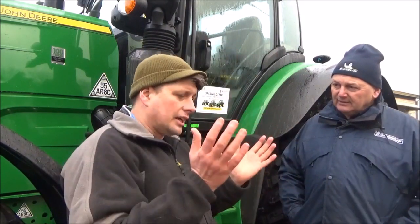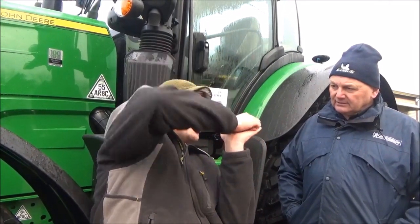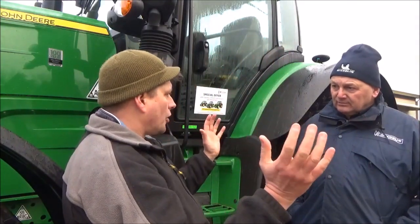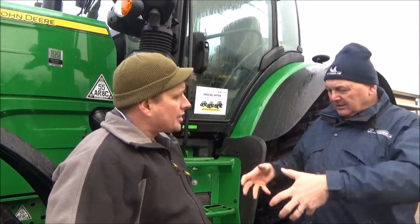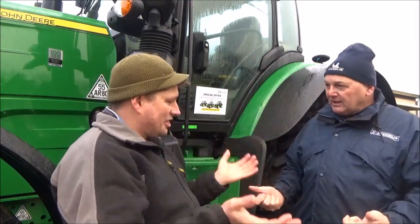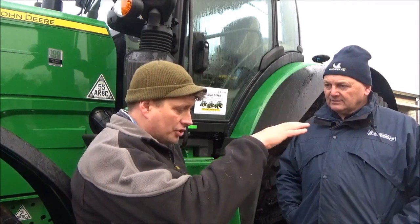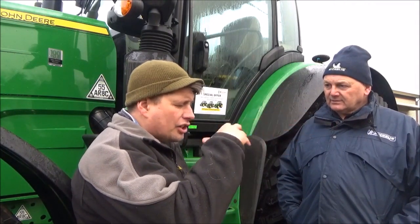Rather than just a little point being in contact with the ground, Henry almost had like a crawler track footprint - it was phenomenal. I've shown you a picture of the Evobib and the differences between a road pattern in the sand - the one that makes it hinge. And everybody's first comment is, well, that's nearly like a quad track. Henry was on grade one silt out at Holbeach Way - beautiful ground - and like he was saying, if you ran your tyres hard, one turn and you're in up to your axle.